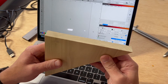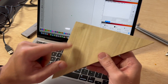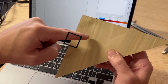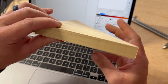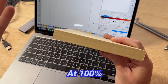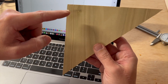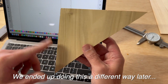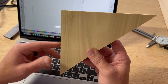So this is what we're going to use to do some testing — just some hardwood scrap. What we're going to do is come up with a design where we can basically draw a box that comes out of the material, so we can measure how far down or how deep the laser goes at 100% power. We're going to do several passes — labeled 1, 2, 3, 4 — and we'll do that with both the 10-watt and 20-watt laser heads.